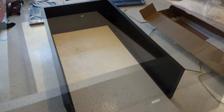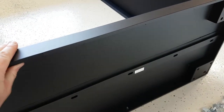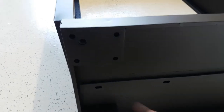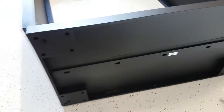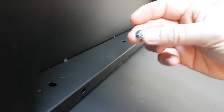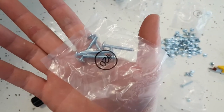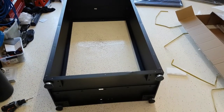Those dents I showed you on the side panels are on the back, so hopefully they won't be much of an issue. Now up to putting the bottom panel on — it's pretty heavy-duty construction, same as the top except it has double rolled edges and heavy-duty parts welded into each corner which your legs screw into, plus a rib on the bottom. When bolting the bottom one in, be careful to use the right screws — the massive pack of button heads won't fit through to the bottom, so you have to use the number 20 screws, the longer ones.